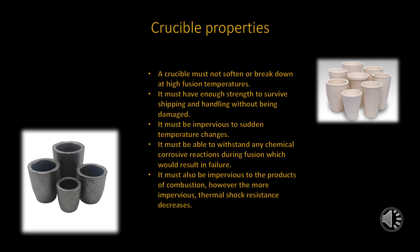Crucibles have to be tough in order to withstand the harsh environments that they are placed in. They have to be tough enough to withstand high temperatures without softening or breaking down due to melting. When boxed and shipped, they are subjected to harsh handling by the shipping companies and must be strong enough to survive the trip. In furnaces, doors are opened and closed, causing temperatures to fluctuate considerably, so crucibles must be able to resist sudden temperature changes. During the fusion process, chemical reactions take place, some of which are corrosive and will eventually eat away at the crucible, resulting in failure and loss. Combustion gases may also be erosive, resulting in deterioration of the crucible.